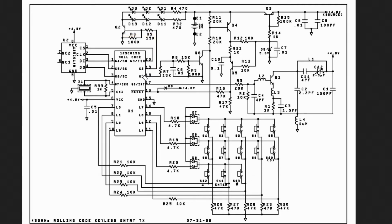So that's what G1 is for. When G2 goes high, when you first push the button and the LEDs go on, G1 also goes high. And what that does is that turns on this transistor, and look here, this transistor also pulls this base to ground. So now this will stay on. Even if you push a button, everything turns on, and you release that button, it doesn't matter. This will stay on because G2 and G1 will remain high for 5 seconds, because this transistor has been turned on, which keeps this connected to ground for 5 seconds.